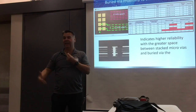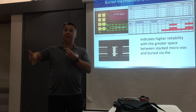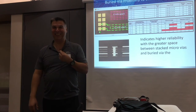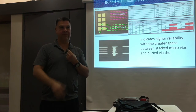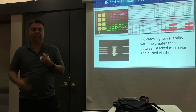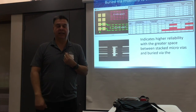So what I'm doing now: every time I get a coupon, pass or fail, I'm looking at the laser vias, the stagger, the buried mechanical spacing — it's starting to reflect in the data. It looks like if you're 12 mils and under, sometimes coupons show up as failures, but when they're far enough away they pass. Maybe eventually we'll define: a stagger of this spacing works, and you're still getting more via density, you can stack two — stop, stagger. Which is real hard to do at 0.35mm pitch. For spacing, I always measure the edge of the laser drill, not the pad. For buried mechanical drill diameter — for the most part at one facility almost all buried mechanicals end up being 7.9 mils, sometimes 10. One of our other facilities uses larger laser vias and sees those go 24 cycles without failure.